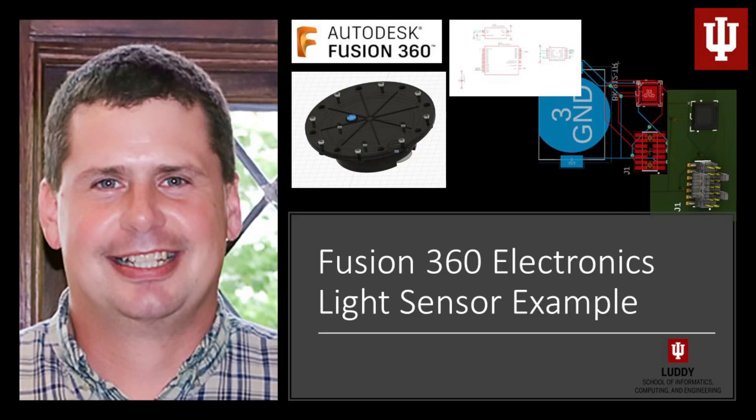Welcome back. In this video we're going to finish up the placement and then work on the routing of the board. We're going to take a pretty simple approach and auto-route this board to keep things moving quickly. I'll demonstrate how to hand route, but a lot of these early prototypes are going to be auto-routed and that's okay. When you go into production, you really want to make sure the routes are exactly the way you want them for manufacturability — there are just some things the auto-router doesn't do perfectly.